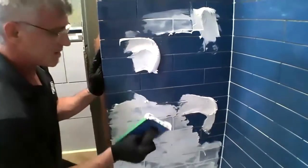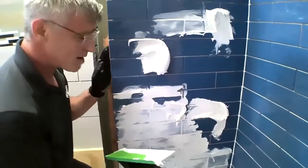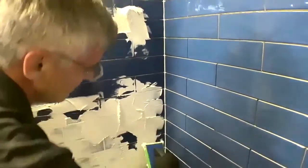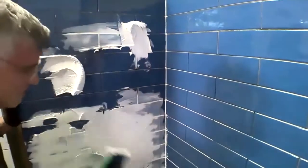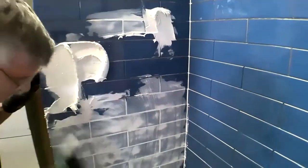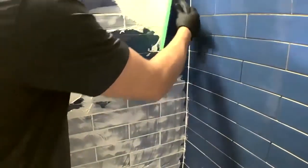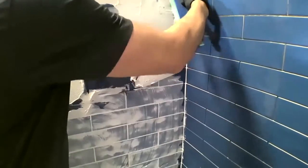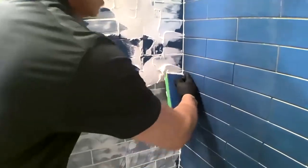So with some epoxy grouts, I have seen where people will grout like around the edges of the tile. At ARDEX, we don't recommend that. We actually recommend that you apply grout over the entire surface, and then squeegee it off. So we decided to use the ARDEX WA on the wall because that is one of the complaints that we get about epoxy grouts, is that they sag and they're difficult to use on wall applications.